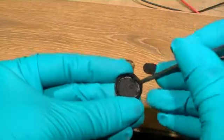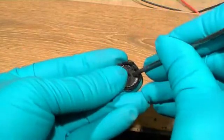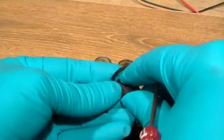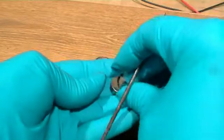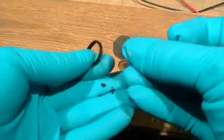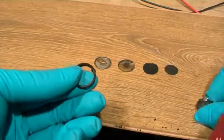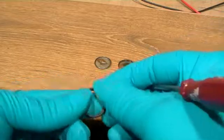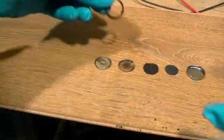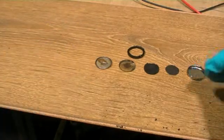The next component, hiding in the bottom of the can, is a current collector plate which sits between the manganese dioxide and the can, providing the electrical contact between the manganese dioxide and the positive side of the can. This appears to be a cylindrical grid of metal. Finally, we can see a plastic o-ring which provides the hermetic seal of the can and also insulates the positive terminal from the negative terminal when the can is crimped.